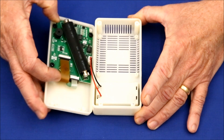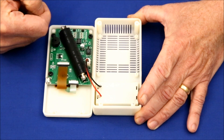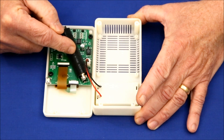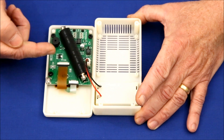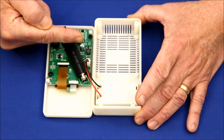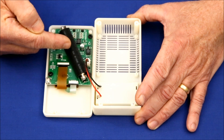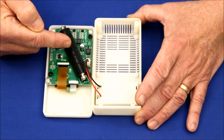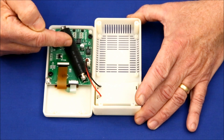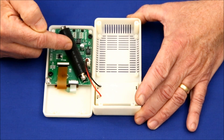Removing the back reveals the classic Geiger-Mueller tube that's the heart of the detector. It's a tube filled with a gas at low pressure and two electrodes with several hundred volts DC between them. When a charged particle passes through the tube, it ionizes some of the gas and the voltage accelerates the released electrons, creating additional ionizations to produce an avalanche of current, which is amplified and sent to a speaker to produce the counter's classic tick. This signal is also sent to various counters and the visual display.